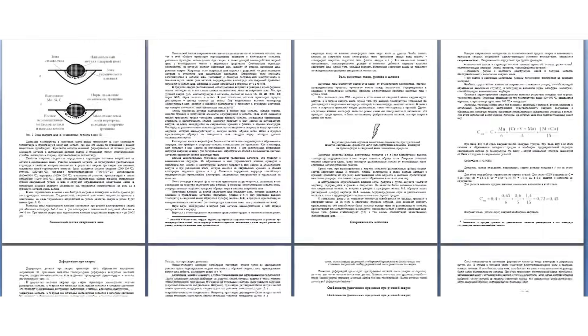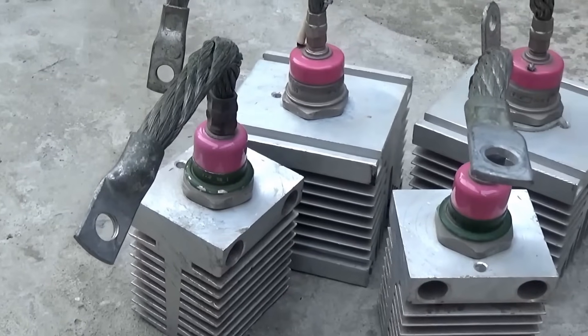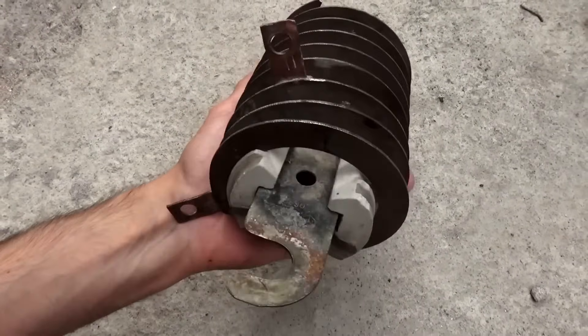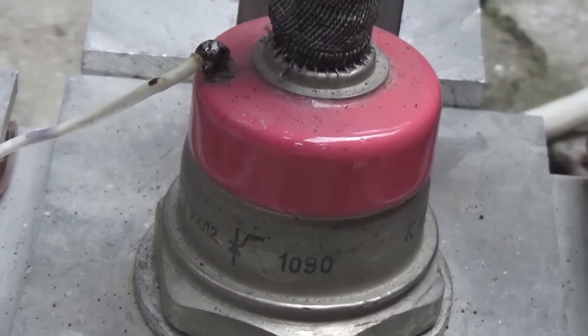If you're interested in welding, I highly recommend it — and this is not an advertisement. In general, there are several ways to regulate welding current: using a load ballast or resistance; switching taps on the primary winding of the transformer, but I don't have those and I'm not planning to rewind the transformer; and finally, the electronic method of regulation, usually with the help of a thyristor.